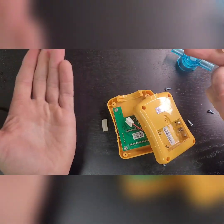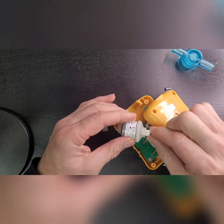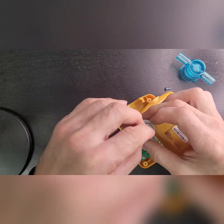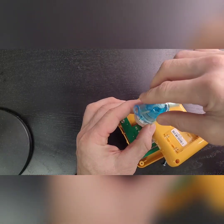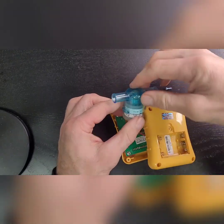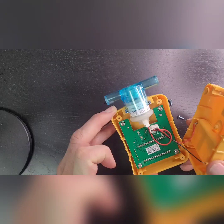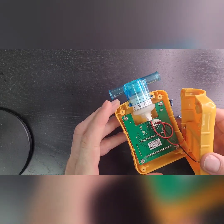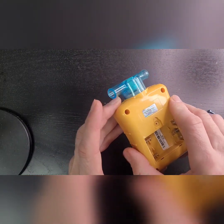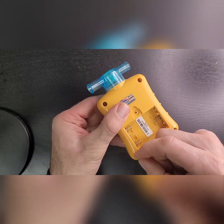Let's assume this is a new sensor. Put it in, insert the jack — it's polarized so you won't mix it up, not to worry. Make sure you put the little honeycomb insert inside so that the air gets distributed well when it's coming in. Turn the manifold all the way until it's finger tight, then pop it into the little guide — you can see the guides there. Make sure there are no screws rattling in there. We have the PCB board, the connector, the sensor, and the ABS casing. Put your screws back in, finger tight.